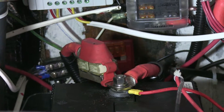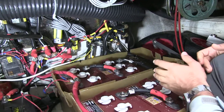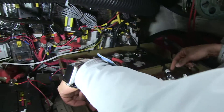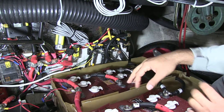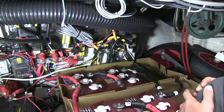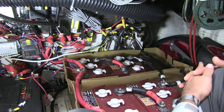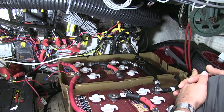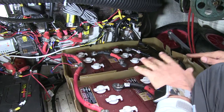On this battery bank, which I really like, you've got four golf carts here wired in 12 volts. You can see there's parallel jumpers, and each pair of golf carts is wired in series. What you'll notice is the positive and negatives are coming at opposite ends of the battery, and that's going to be essential to keep the batteries charging and discharging evenly.